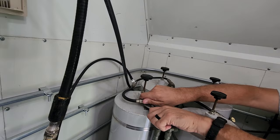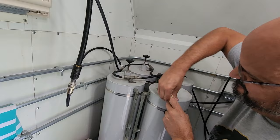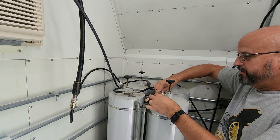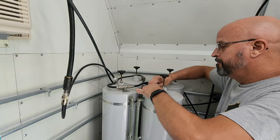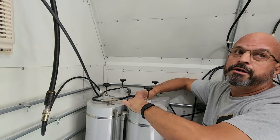What we're doing here is putting the harness back on our original duplexers. We thought maybe there was cabling bad in the harness, and that didn't fix the problem. We replaced the harness with another one and it didn't fix it. So KD6FTR is putting the original harness back on, and then we're going to re-hook everything back up, which it didn't fix anything. The receive side of our repeater is just getting hammered and we're not getting any good audio coming in. It transmits just fine.